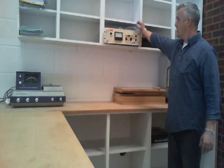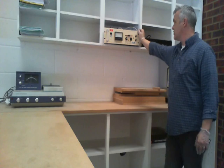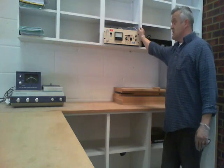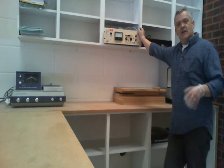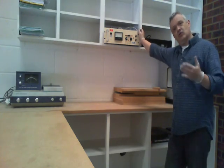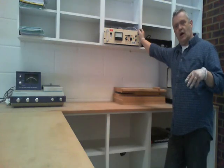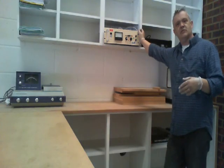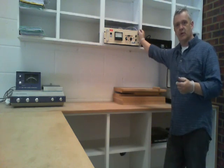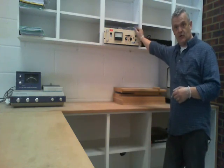We've got a 60 kilovolt benchtop high voltage power supply. The reason I've got that is for the piezoelectric inks — when you're using piezoelectric materials, you have to condition the ink. You can't just grind up the piezoelectric materials; you have to condition them using a high voltage supply. So this is for the piezoelectric stuff.